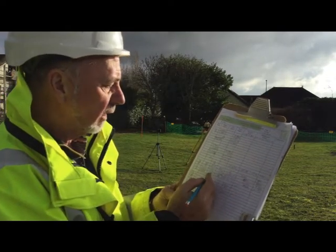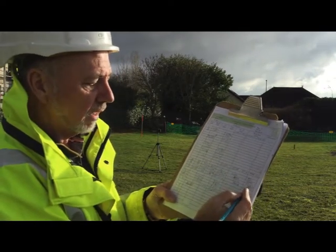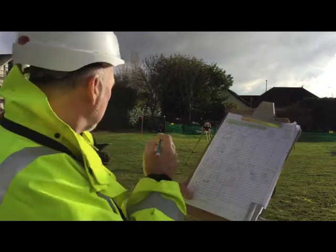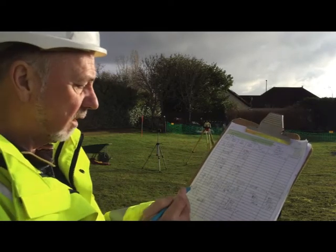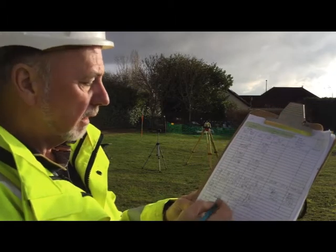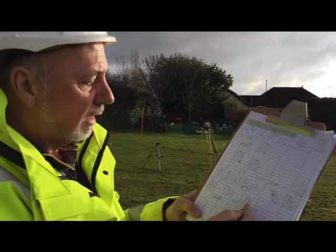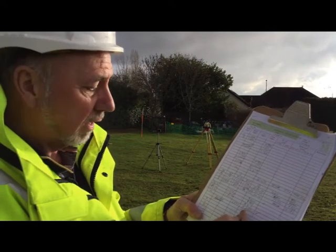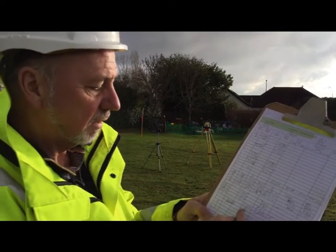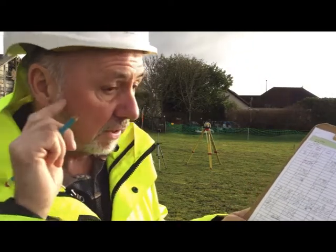I've taken off the middle readings for stations C and D and got 9.942 and 10.192. I then took the three levels I took next to the poles, which were the pole in the road, pole mid, and pole by the trampoline, and these came out at 9.805, 9.805, 9.915. Then closing back on the foresight onto station A was 10 metres with a foresight reading of 1.230.